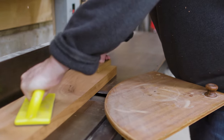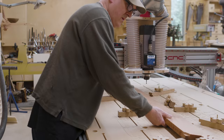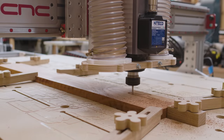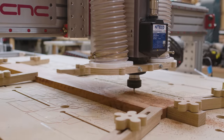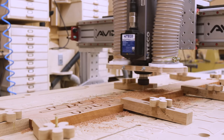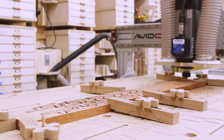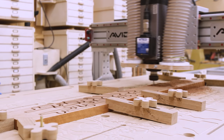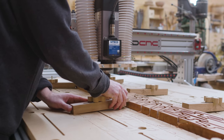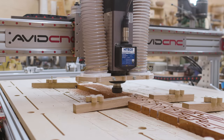I can joint and plane the piece of kaya. So I have the cherry inserts cut, and now I cut out the kaya inserts. At this point I was trying to lay out the inserts so the grain would follow across the seam between the triangles — that's why they're at odd angles in the piece of wood. As the wood is a long shape, I can do a section of it and hold that section in place, then stop the router and move the hold-downs and do another section, which means I can use more of the wood and keep a long shape secure to the table.